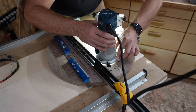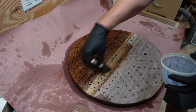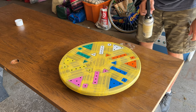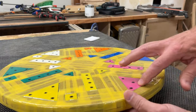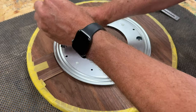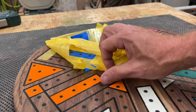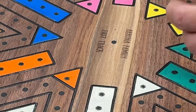So I had to scrape it all off and sand it back to bare wood again. I even had to reroute the lines. I reached out to my woodworking community on the Lumberjocks forum to get some guidance on finishes that would be compatible with each other, and came up with Danish oil, which is really dummy proof to apply. You just flood it on with a brush or a rag and then wipe off the excess. I let that cure for a couple of days before repeating the whole process of painting on the lines and colors. Then, to protect the color, I used a spray shellac instead of lacquer.